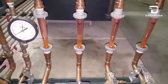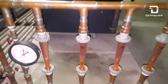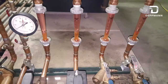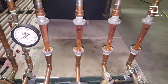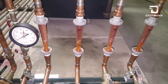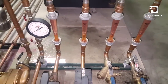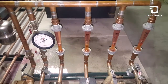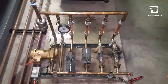After one water change, you can see it's now a light pink hue compared to that dark orange it was earlier — and that wasn't even a full system water change. This shows that a few leaks over time, someone servicing the system, or any other way water leaves and gets replenished can create a huge difference in glycol-to-water percentages, and the system is just not operating the way it was designed.